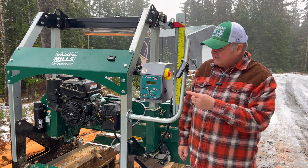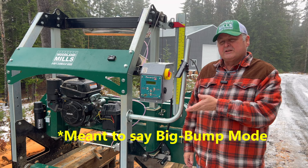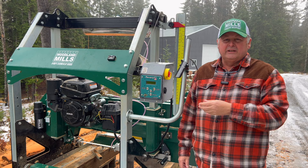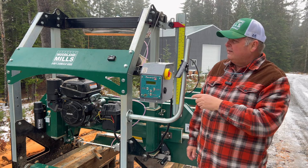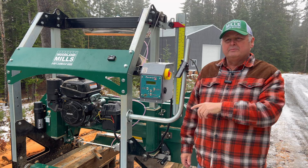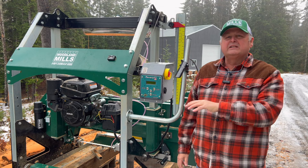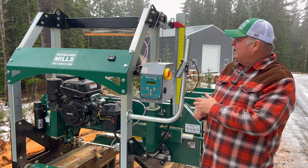What I'll be doing is set the lift into bump mode, set that setting at 10 inches, and then run a test going up with a timer so you guys can see it. We'll take however many seconds we get and divide by 10 to determine the speed in seconds per inch. Then I'll run the same test going down to see if it's a little faster when not under load, or if it's a controlled descent at the same speed.